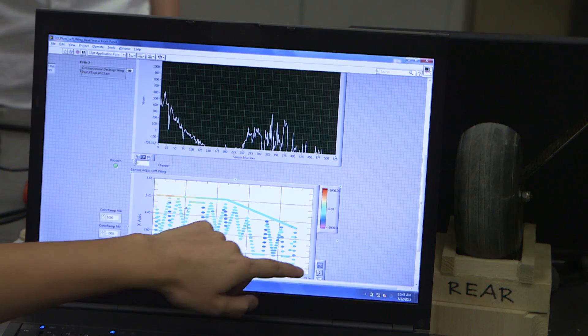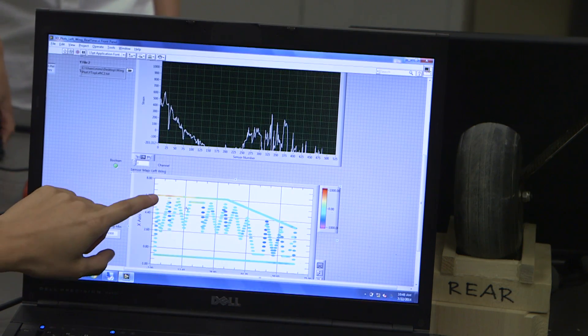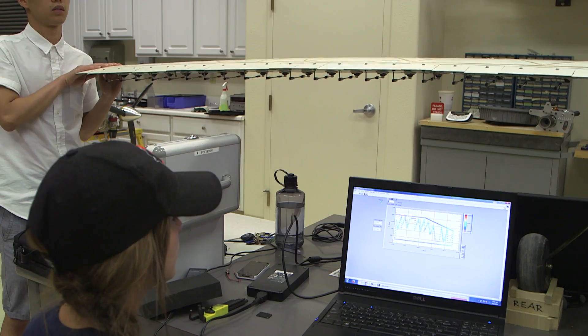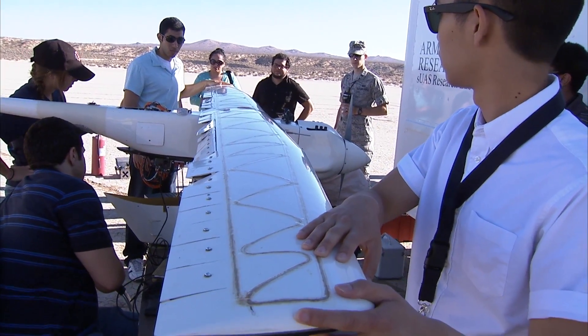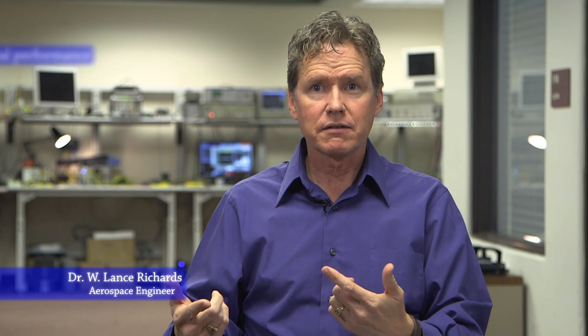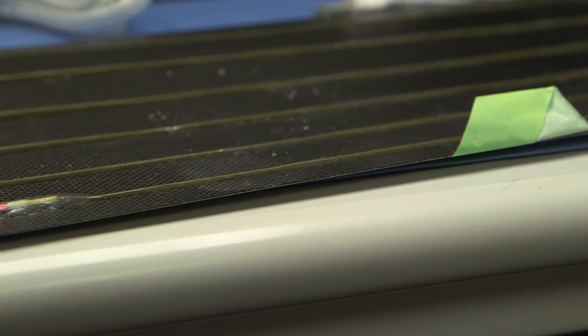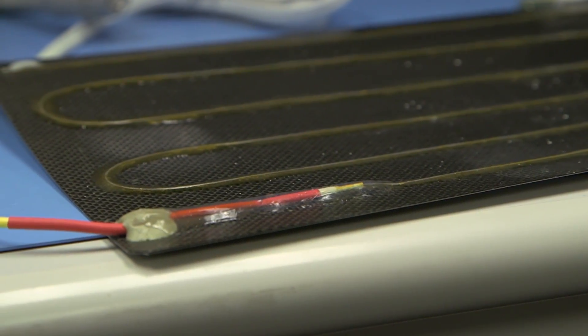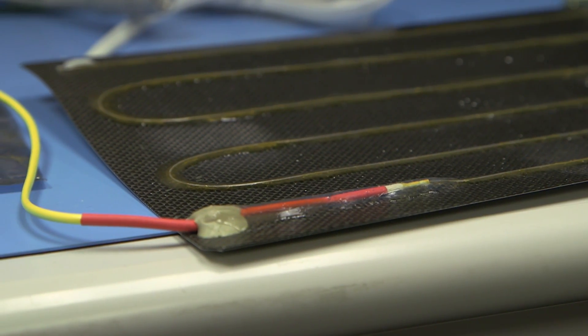These are all the individual fiber optic sensors on the wing, and these are the individual strain values. You have deeper insight into how a structure performs not only in operation, but all the way through its life cycle — from development and ground testing, through flight, to determining how much life is remaining in the structure. FOSS can save time on your schedule for installing sensors and can give you greater insight and much more spatial fidelity in your measurement system than ever before.